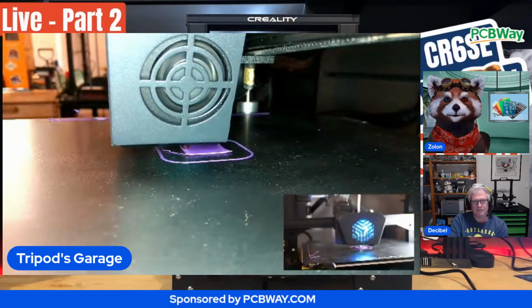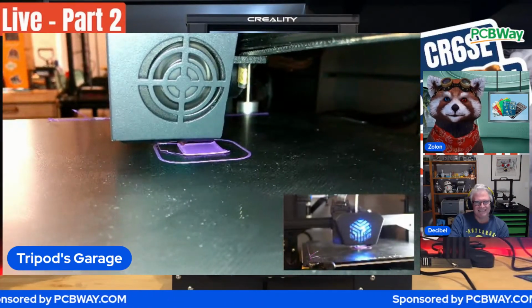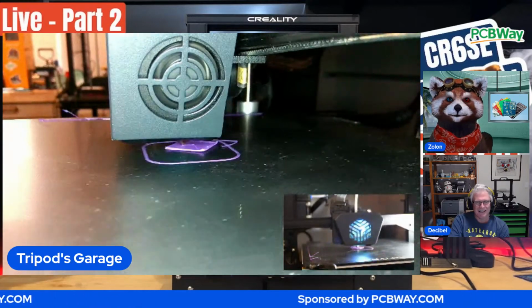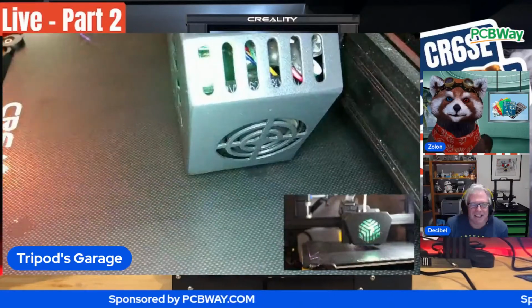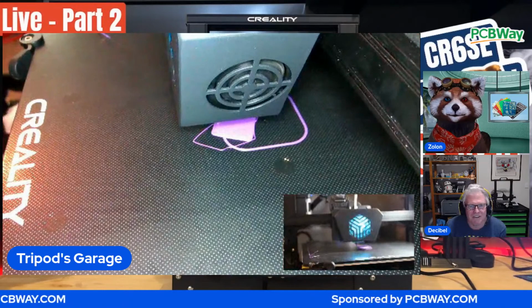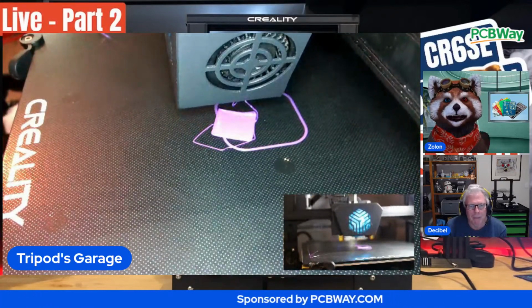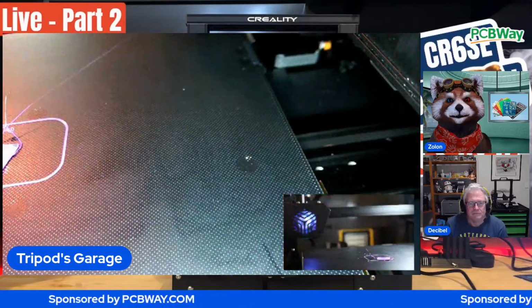This thing's gonna fail. It's curling everywhere. Curling big time, yeah. So let me just stop it. There it goes. But that's no reflection of the printer. That just needs a bit of cleaning and your Z height. That's why I said it right away, I didn't clean the bed. This glass bed, yep. Look at that, it's just the purge line.